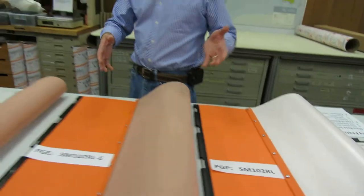However, if you're printing only packaging material, board stock, or thicker paper, that's why we have this one with the fabric backing. It comes in at about 20% thinner, or 0.8 millimeter total thickness, allowing a little extra room in the gap between the transfer and impression cylinder for that thicker paper to be printed.